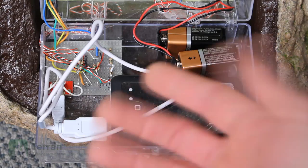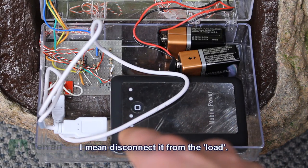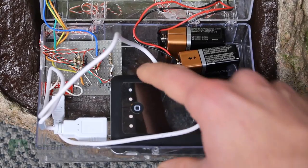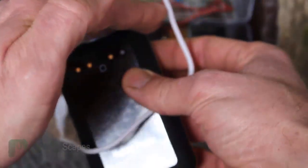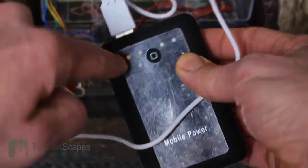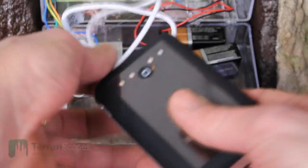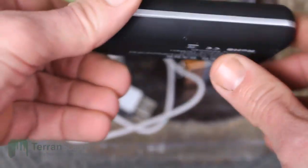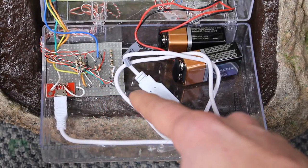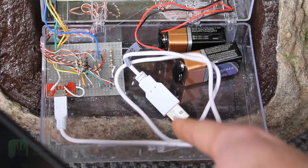There's an on-off switch — it's a little weird. The button turns it on, and the only way to turn it off is to disconnect it from the source. It detects when there's no draw on it after about 30 seconds. It has an automatic low-voltage cutoff to make sure it turns off. When you unplug it to turn it off, you can also charge it. It charges by micro USB. The cord is micro USB on both sides, so you can actually just pull it out, rotate it, and plug the micro into here and then into your computer to charge it. I will be supplying the customer an additional cord so he doesn't have to fiddle with this.